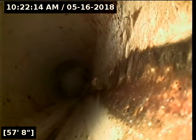Okay, the belly ends here at 57 feet. We're going to do locates. I'll put an X marking at either end of it. Yeah, put an X marking out in the street area. The line kind of crosses from the left side of the property over to the right. It kind of ends up down the street from the driveway area. We're at 4 feet 10 inches deep there.